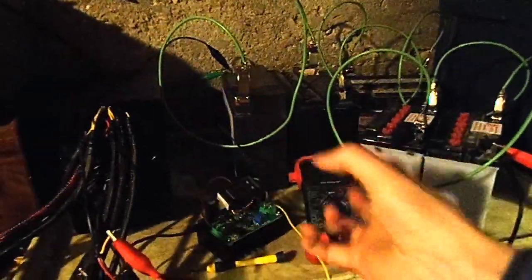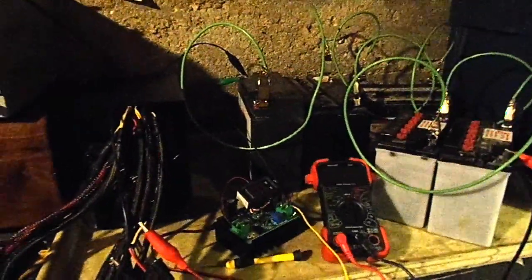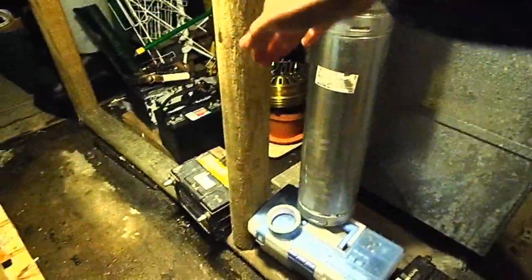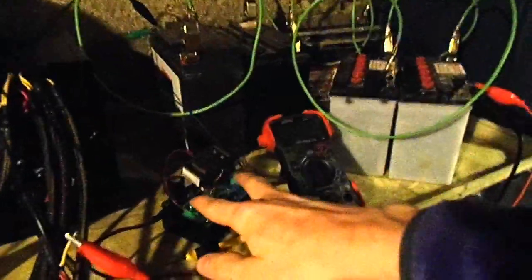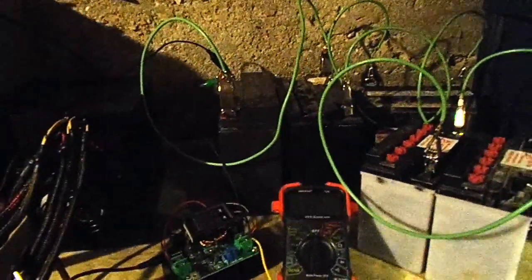Now the big deal is that this entire charging setup is a little cumbersome. I want to build a big charging station outside — I'm going to take a 1960s petrol pump, because I think it'd be very stylish to build a charging station out of an old gasoline pump. I'll take out the pumping mechanisms and install deep cycle batteries into it, with solar panels on top or on my roof connected to it. It'll take power from the solar panels, charge a 12 volt bank — possibly in a rain-proof box next to the charging station — and then I can use this step-up converter to go up to 80 volts to charge my lawn tractor, charge my electric bike, or weld with it. So there's plenty of options for that old petrol pump.